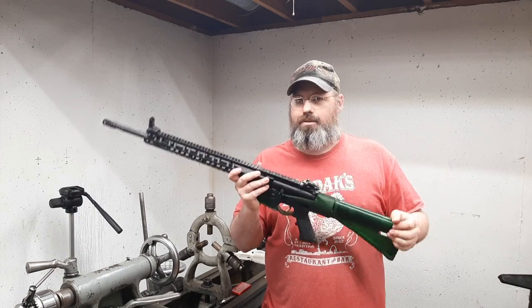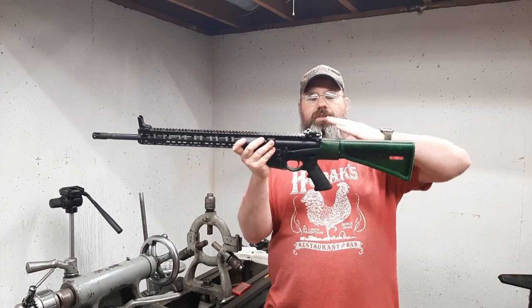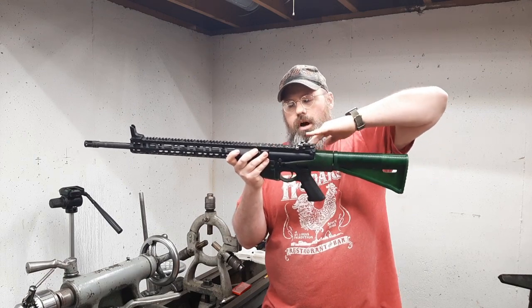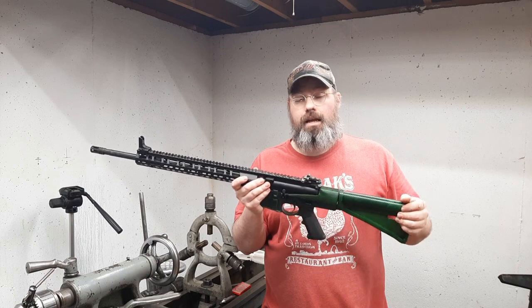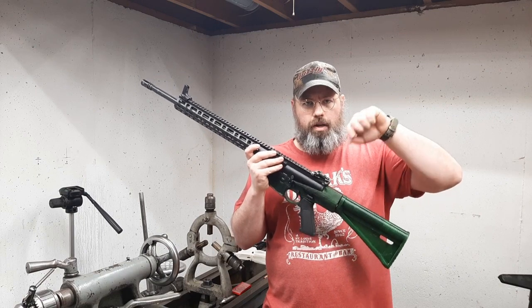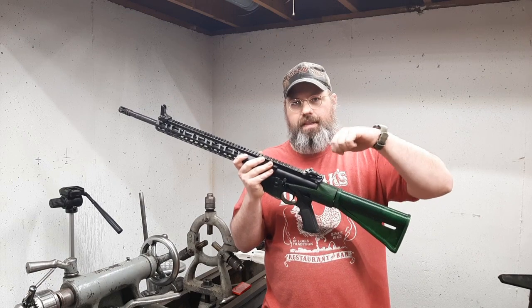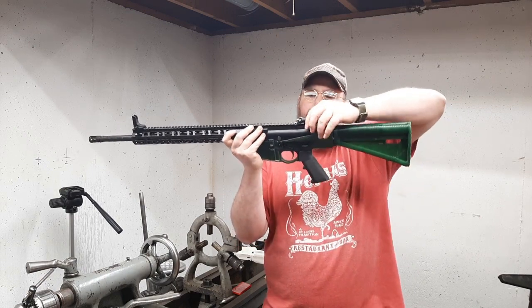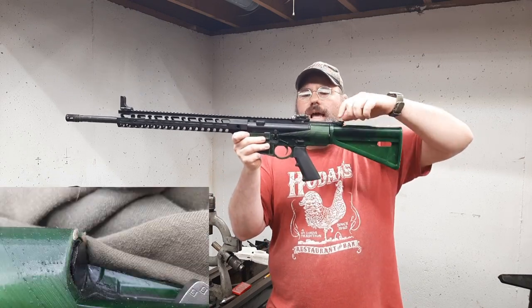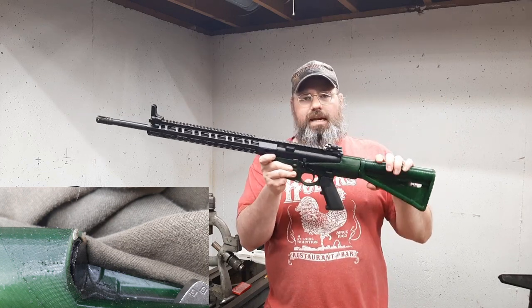The post-mortem on it was that the filament warped on me a little bit, so the buffer tube was no longer in alignment with the upper receiver. I remedied that after the fact by plastic welding — I took a piece of dried filament and a soldering iron and worked it in there to build that up right in this area here. That straightened things out and eliminated the binding issue.